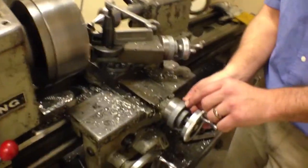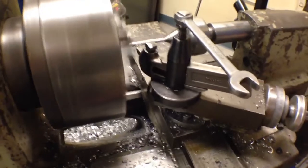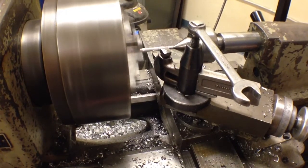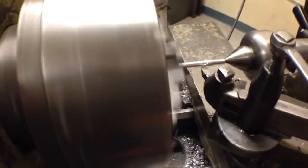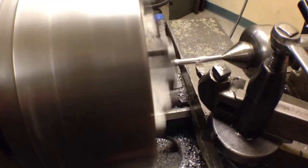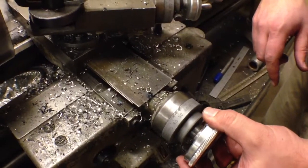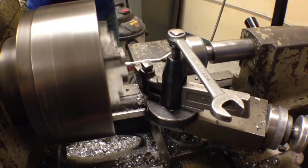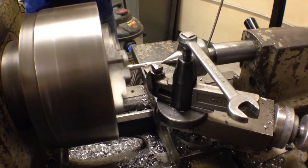So I've cut 15 thousandths off the dial — I'm just rough cutting. I'm going to go another 15 thousandths and feed this in. This is just rough turning, which means we're just removing a bunch of material now. I don't want to go past that point where I went the first time because it's going to put too much load on the test piece. Wheel back, just in front of where I started cutting, feed in another 15 thousandths, and stop right before — so that kind of has a natural neck down.